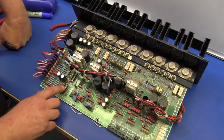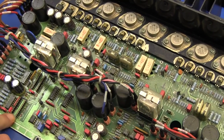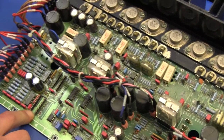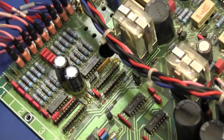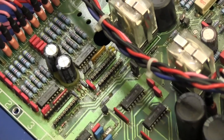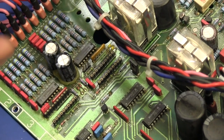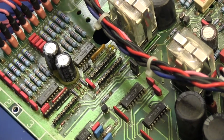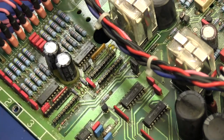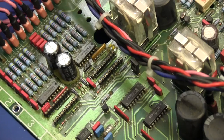So this is simply the change in manufacturing technology over the last 20 years, which has made huge differences to the strength of the input pin internal pull-ups. Now, they've also become faster, but let's face it, this is dumb switching of mic signals. We can't tell the difference between 50 nanosecond or 20 nanosecond performance. Tell it like it is, Doug.